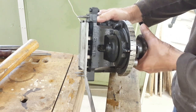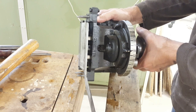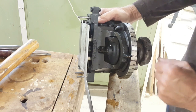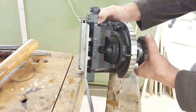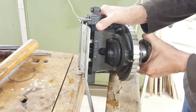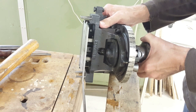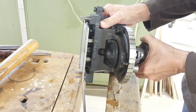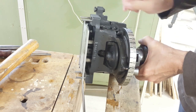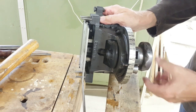As you change molds you want to be able to change the spacing of the knives, and that's what this block does. It lets you select the spacing. Right now it's set for 14 point casting. The way you change the spacing is you turn this knob clockwise, pull it out, and that pulls out a pin which allows this selector wheel to turn. You select, say, 12 point and push the knob back in to engage the pin again and lock this wheel, and then the knob will return back to this position.